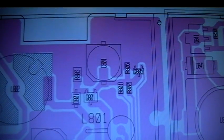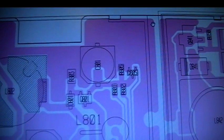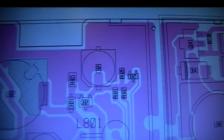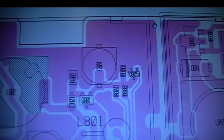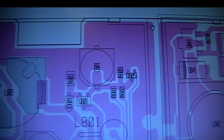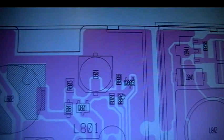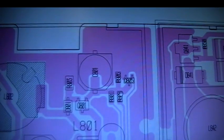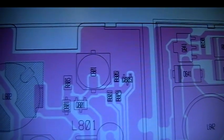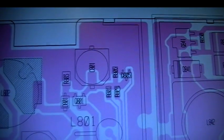I will put a diagram in the description — a PDF diagram of the board, the PCB board I've put together, and the layout of that — and also a diagram for the little circuit we need to put in, just to take the control from this voltage through a transistor, enabling us to put a constant current circuit in to regulate the LEDs that are in the screen.